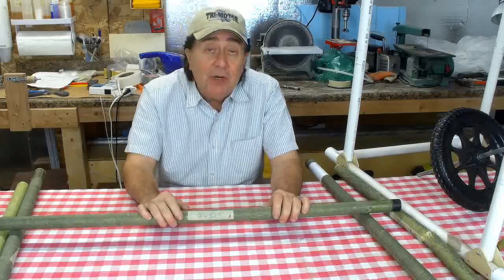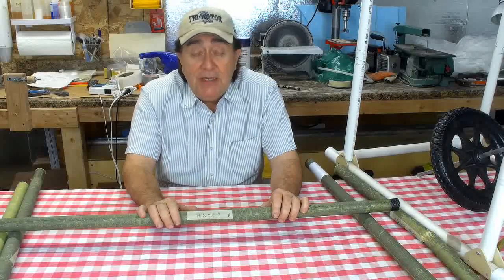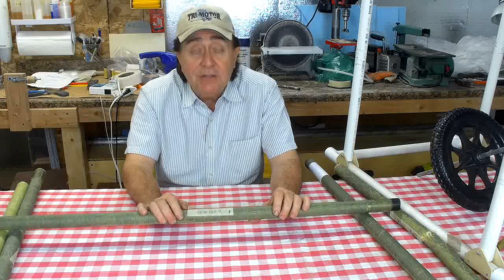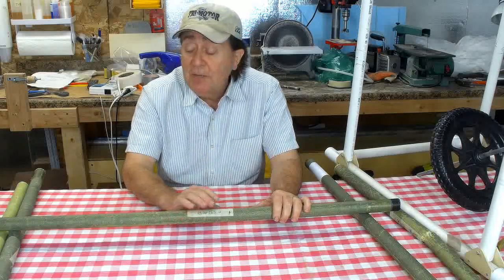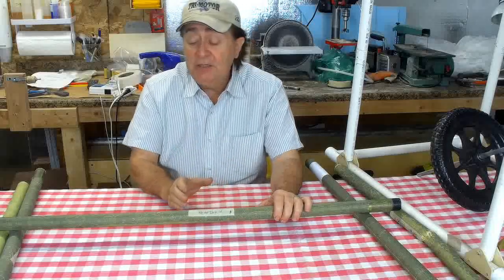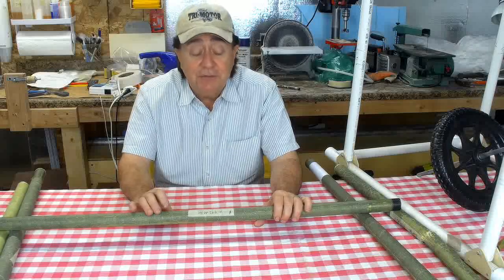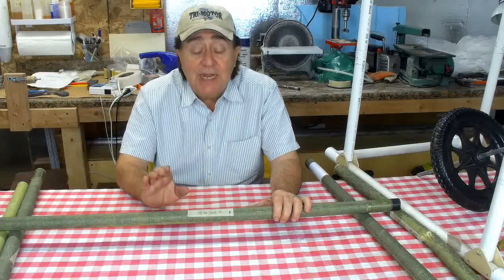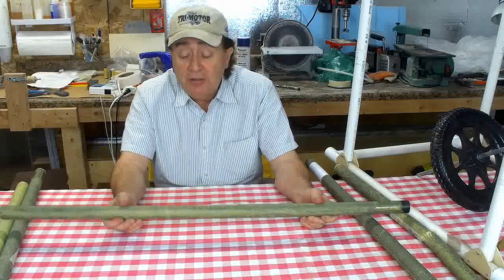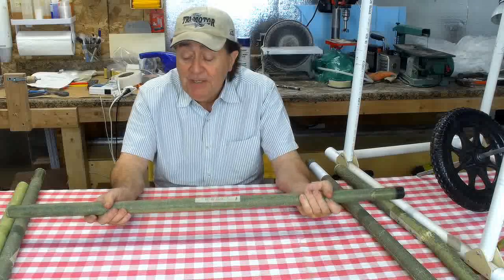And this is a problem that you run into with ultralight aircraft. Everywhere in the aircraft is local buckling. It is a structural phenomenon and failure mode that designers of these types of aircraft have to deal with all the time. And we use a variety of methods to prevent local buckling, usually bulkheads, ribs, stringers, anything to prevent the surface from buckling. All of those methods add weight. I could come in with some super high modulus cloth here, carbon fiber cloth, and that might do the trick, but then it'd get really expensive.